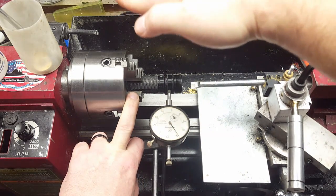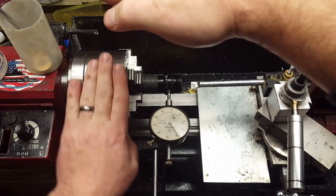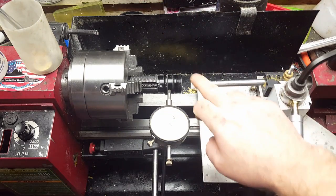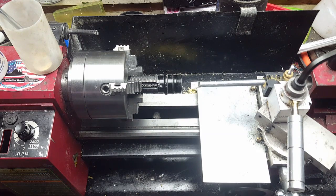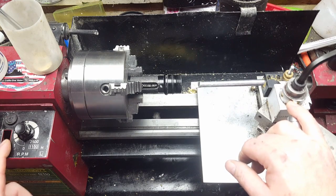What I need to do is make one of these ring light cards for this, so that my Mitutoyo can be seen easier. Anyway, we got that chucked up. We got a boring bar — I have carbide, but I'm thinking I'm going to swap that out. I don't know if I'm going to like how it cuts because it's aluminum and I just cannot go fast enough on this little lathe here.